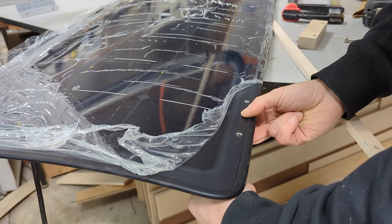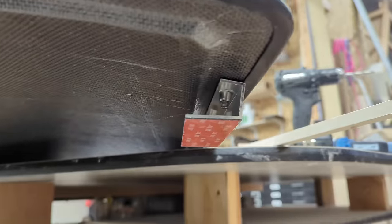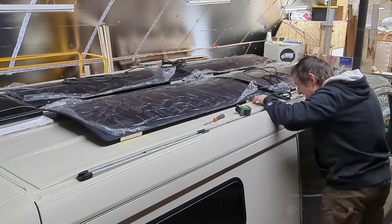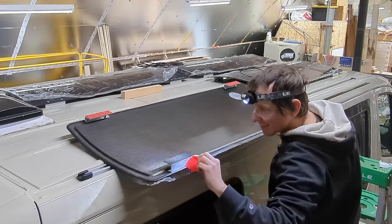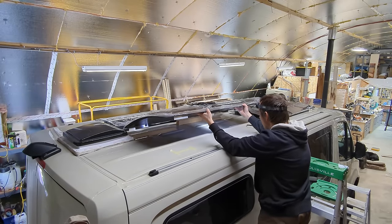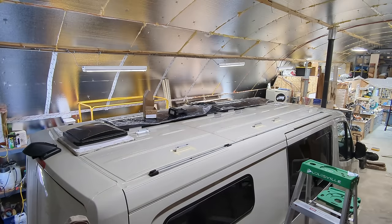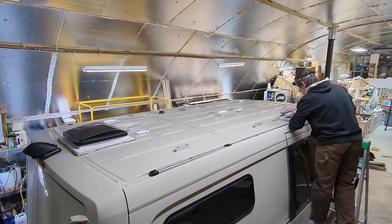As I drill the holes I go ahead and attach the brackets. For the final install I will be using lock washers, but this is just a temporary attachment as I'll have to remove them once the whole installation is complete. To mount the panels, I lay them out exactly where I want them and use masking tape to mark where the little feet will land. On the far side of the panel I can't reach, I use a wood block to let it float so I can precisely set down the two feet closest to me, then pull the wood block out and the far side drops into place. Then I pull the panels off to come back and silicone around those feet for a water-tight seal.